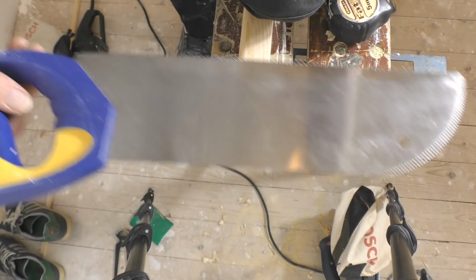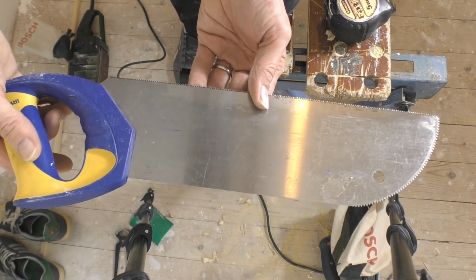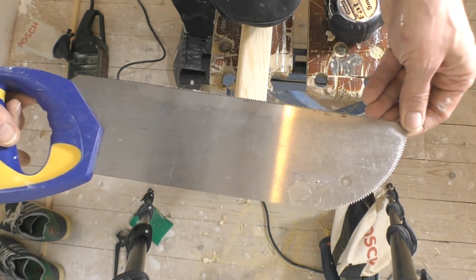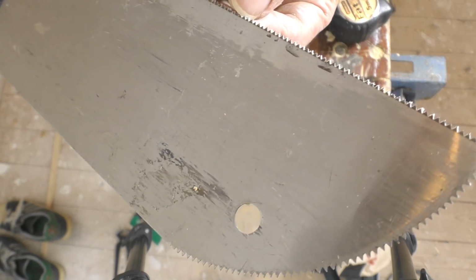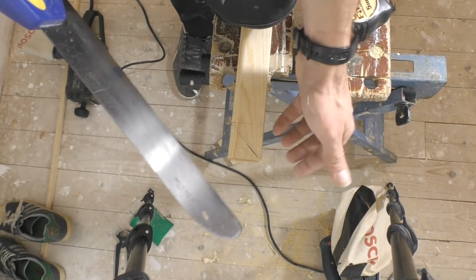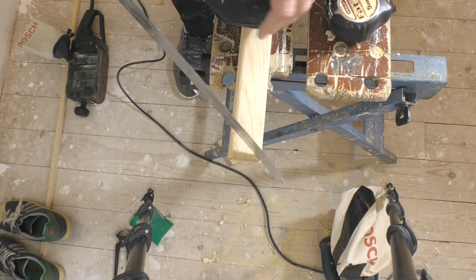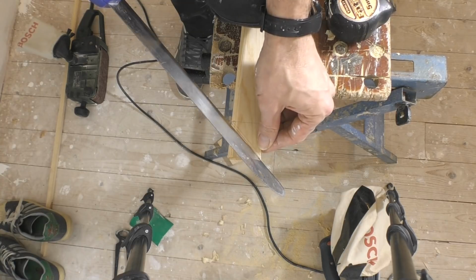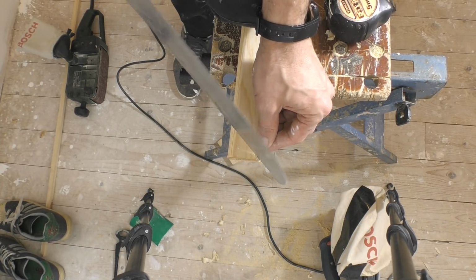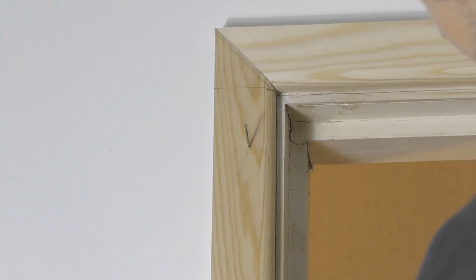First, I particularly like this saw. It's an Irwin floorboard saw. I'll include details of it and where you can get it in the description at the end of this video. But I like this saw. It's got very fine teeth, which is very good for jobs like this because they don't make a mess of the wood and you can be quite precise. But the other point I wanted to make is when you're sawing something like this, try, if anything, to angle your saw slightly into the bevel rather than away from it. That way, when you put your other piece of wood up against it, you'll get a nice clean joint.